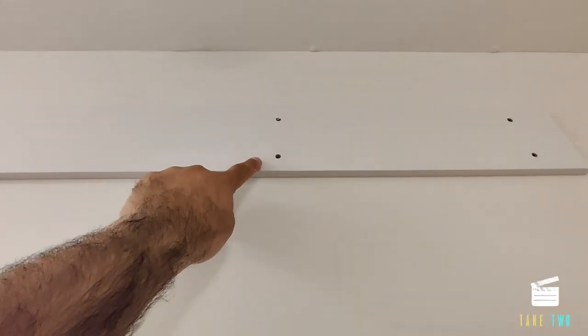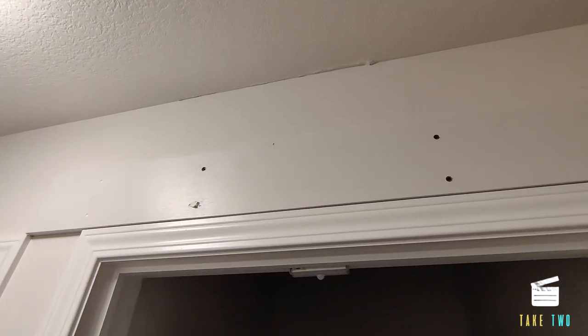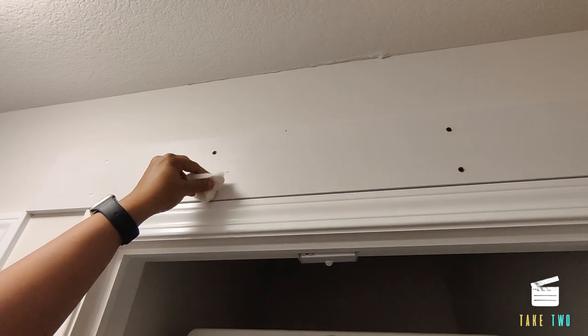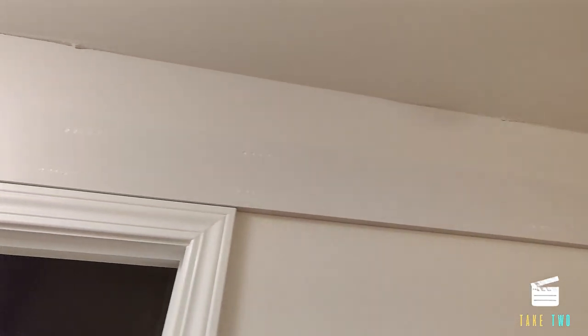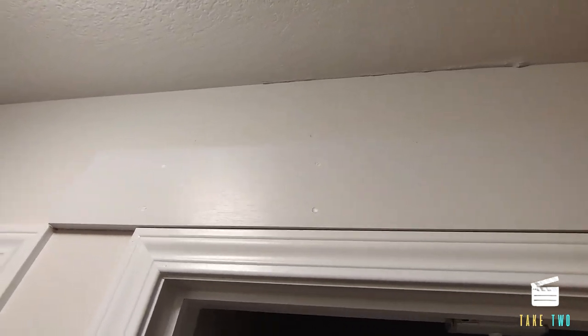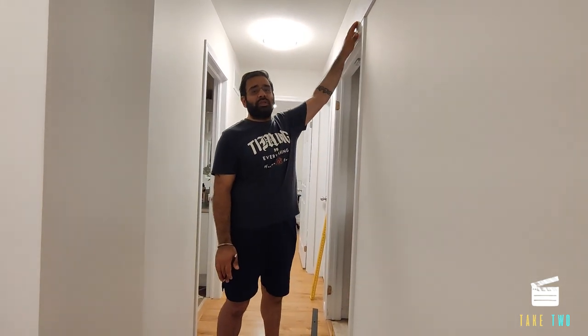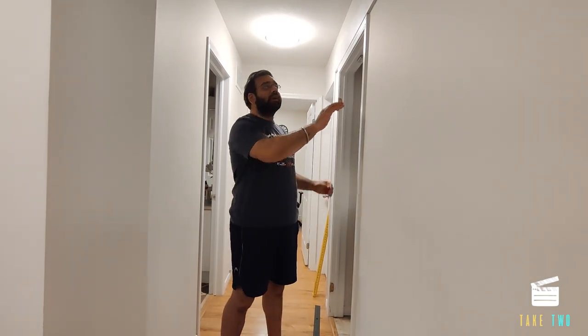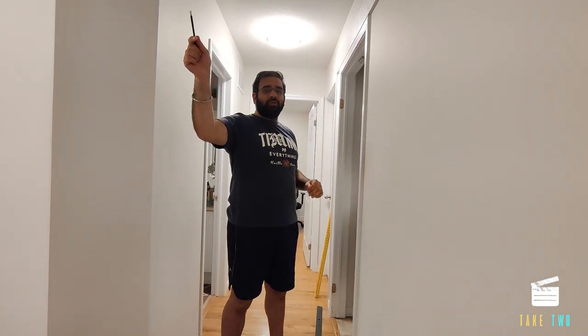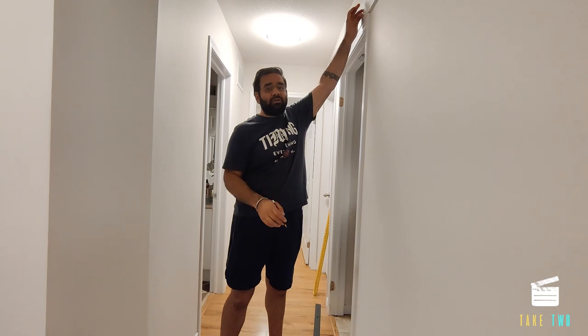The backer board is now attached to the wall, but there are visible screw holes. Angita is filling the holes with white caulking so it doesn't look shabby — the caulking makes everything seamless. After the spackling dries we wipe off the excess from the sides, which looks much better than the golden screw heads. The next step is to install the support bar on the backer board. We place the door to take a rough measurement — the rollers must rest on the support bar — so we can determine exactly where to drill the pilot holes.